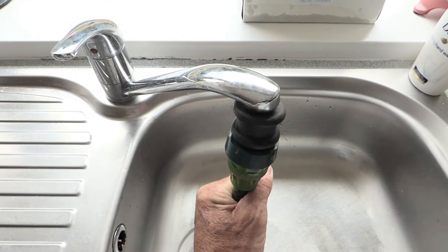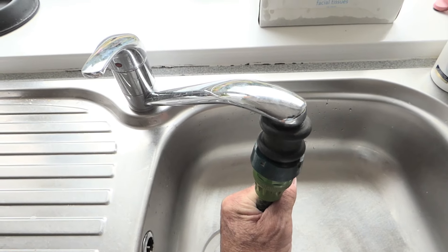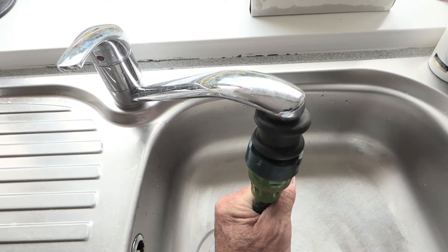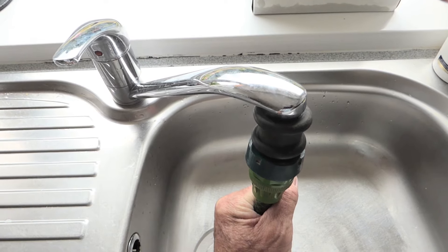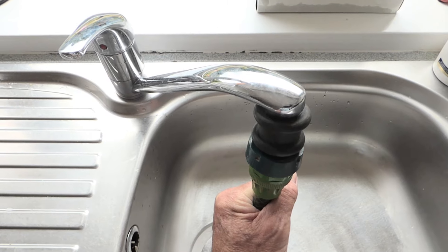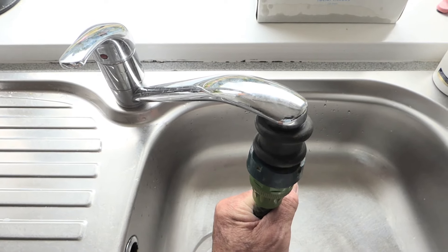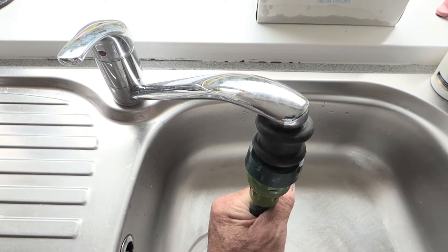There you are — one airlock hose adapter. All you've got to do is get a partner or friend to open the cold tap out there. Make sure this is on the hot side only. If you've still got that terrible airlock and it won't go even with your hand over it, this is well worth a go. If there's a non-return valve on that hot feed it won't work at all, but this is my last resort method for getting it out. It's one people often forget about because they forget they have a garden tap outside, and this will also work for the wash hand basin.